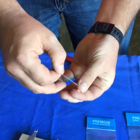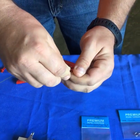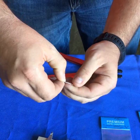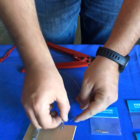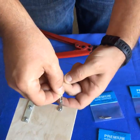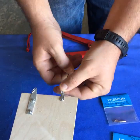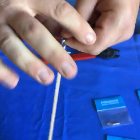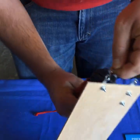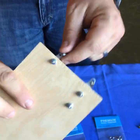You put the cable through the sleeve first. If you're ever having a problem getting it through the sleeve, just cut a little bit off — once it starts fraying it's tough. Run it through the thimble and then put it back through the sleeve. You want to get your sleeve tight into the thimble; I like to get it started and then pull it in with the tool. One crimp is all you need — you don't have to crimp the whole thing, just one nice crimp, it's plenty strong.